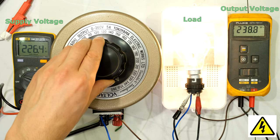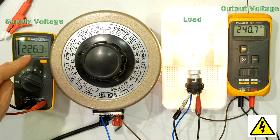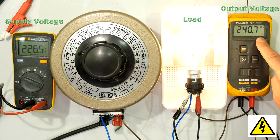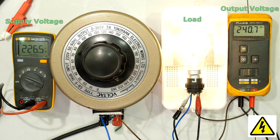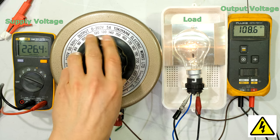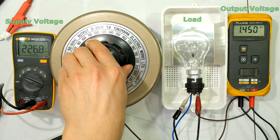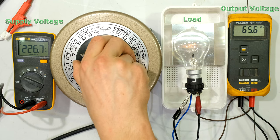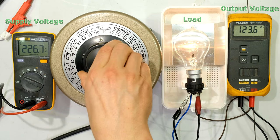I'm going to go a little bit higher — to 240 volts. Notice that the variac is allowing me to exceed what is being inputted into the variable supply. The input is still 226 volts while the output is now above that, which means the coil is extended inside here. I'll open it and show you. I'm slowly reducing it — look at the voltage reducing — and even when I take it to zero the supply is still 226 volts.